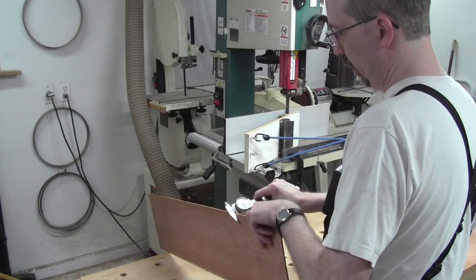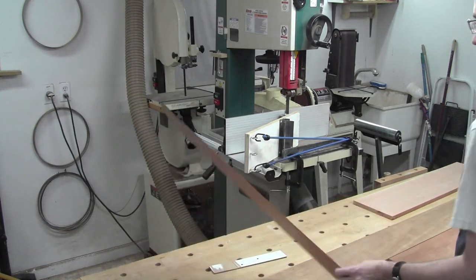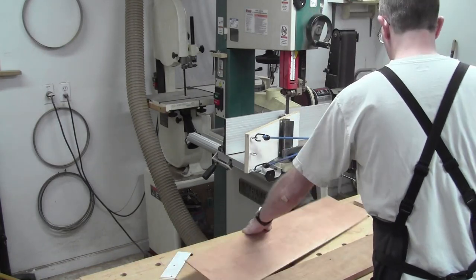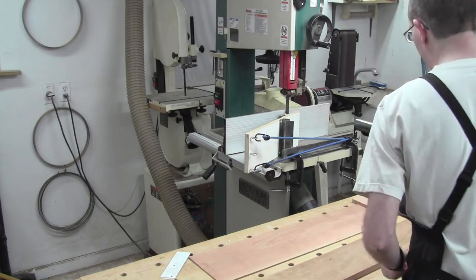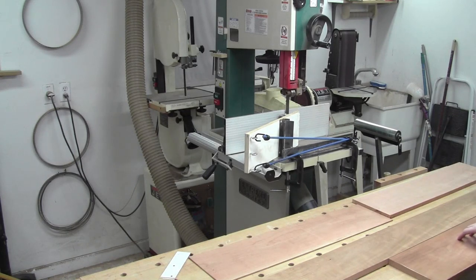That's going to be a problem if I'm trying to conserve and get the most yield. What I need to remember to do is just slow the heck down. Keeping it slow keeps it efficient and uses the least amount of wood. So I'm going to do these other two boards and then address their surfaces — I'll probably run them all through the drum sander real fast, then run another pass and do the same, just keep rinsing and repeating until I get four slices out of each of these.